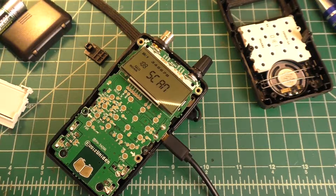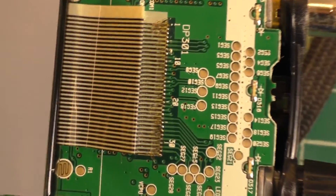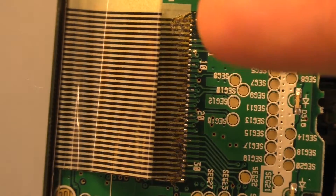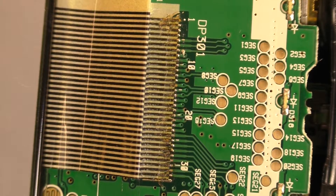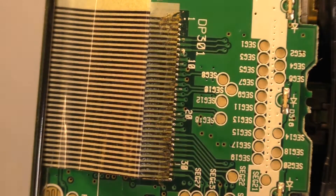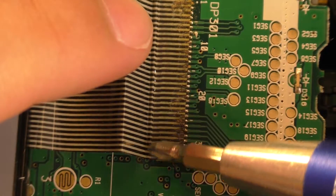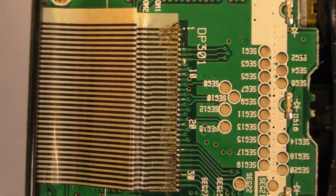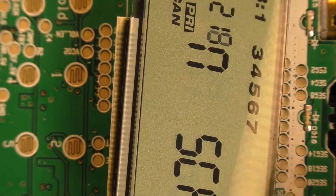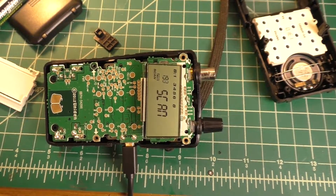I did manage to get it fixed. It's now showing that it's scanning through the different banks and everything on the LCD works — I push this down, it says volume, and I can adjust the volume as it should. When I first tried to fix it, I went after it with a soldering iron, which you don't want to do. I Google searched 'Uniden BC-75 XLT display problem' and someone's video said to take your soldering iron at a very low temperature — I used 400 degrees — and just rub it along the groove area. I accidentally bridged out one connection at first, went back and fixed that, and the display is now functional again.